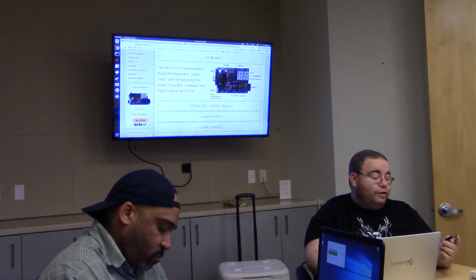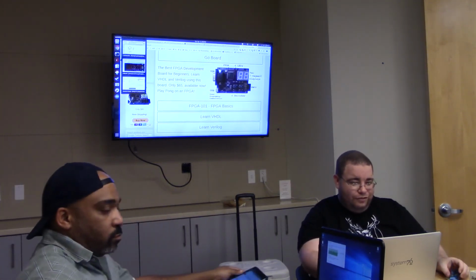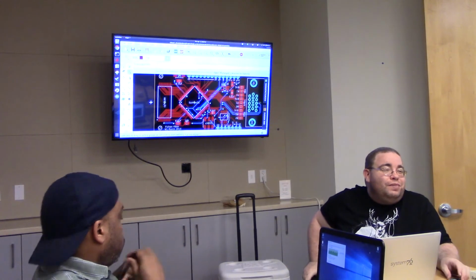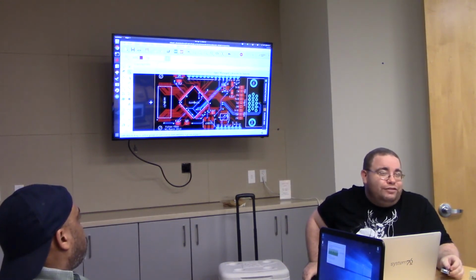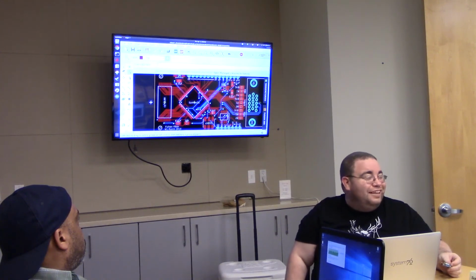The really nice thing about putting an FPGA on a board is that you don't care which pins go to what. This is cool. Check out the routing of the pins from the FPGA to RAM. Because I can assign whatever pin to whatever I want, I just assigned it so they made that nice pattern, to make the etching really easy. It made the routing take 5 minutes.